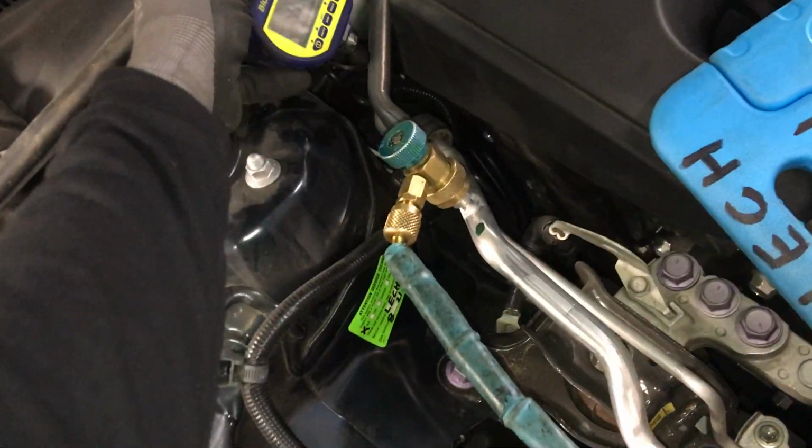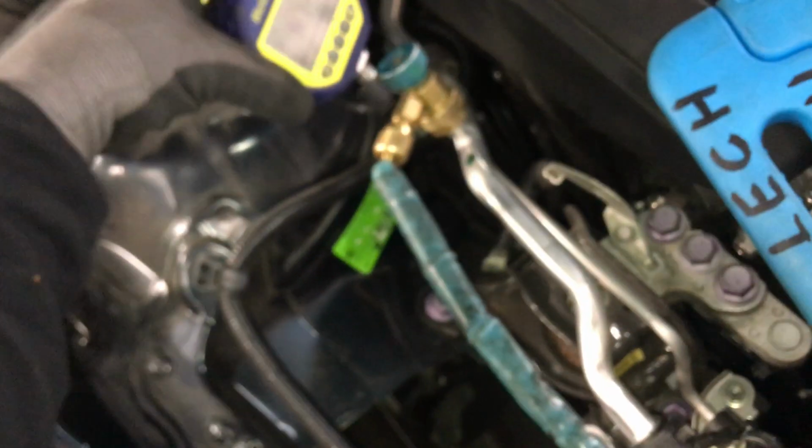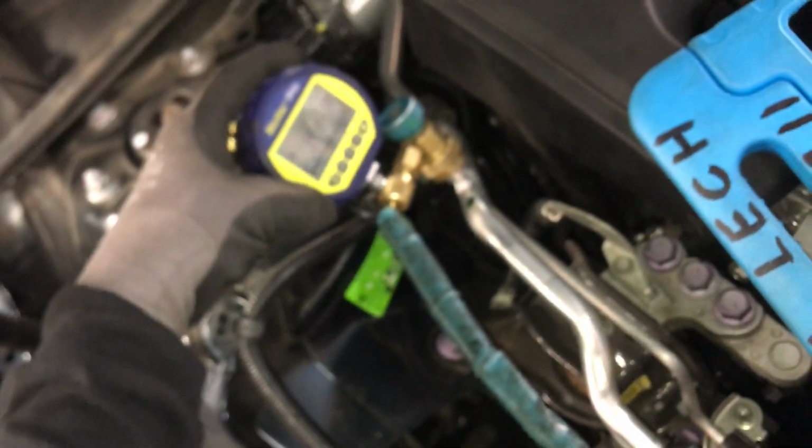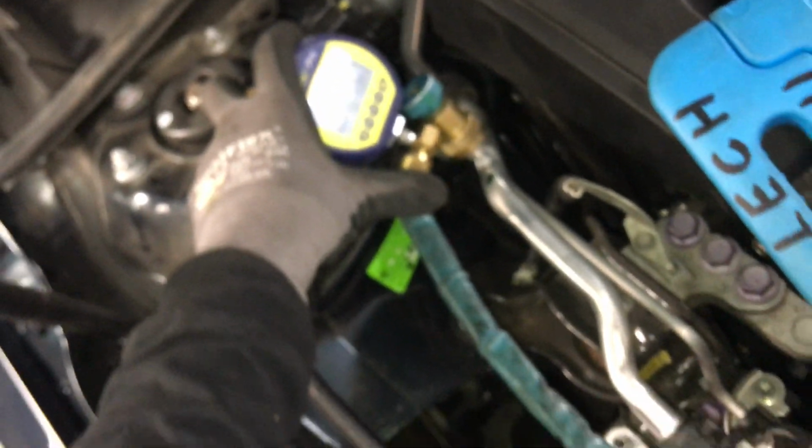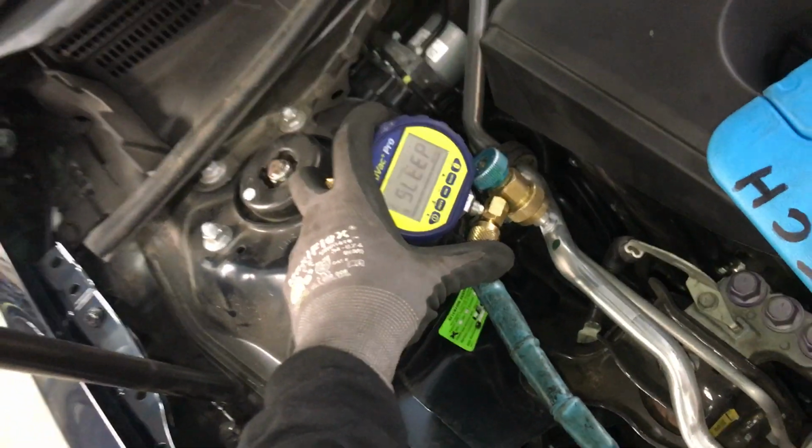So you would have a separate micron gauge like this, and you would have it on a commercial system. You'd either have it set up somewhere where there was a fitting for a pressure sensor, or you would set up, I don't have it here with me, I'm not prepared, but a gauge with a ball valve on it that you can turn off, and you would have your gauge up there that you can ball off from your vacuum. So when you're through with your vacuum, you would have a valve right here and you would shut off the vacuum through your hoses. So your micron gauge is isolated to the system itself, in no way, shape, or form attached to hoses.